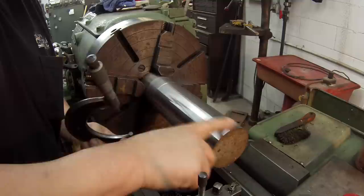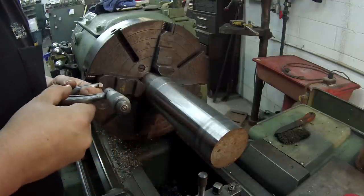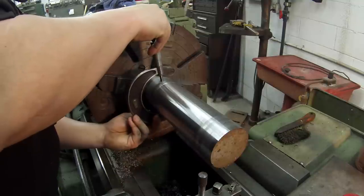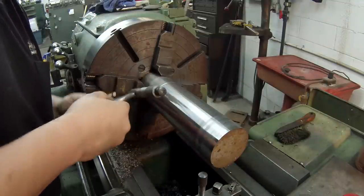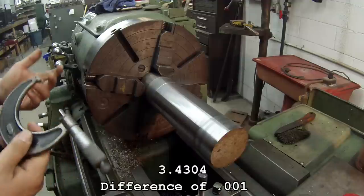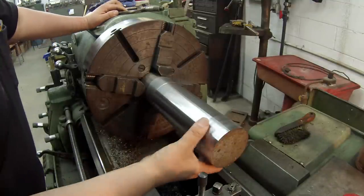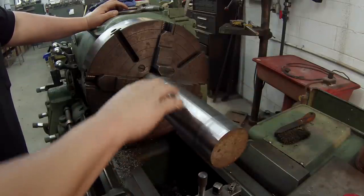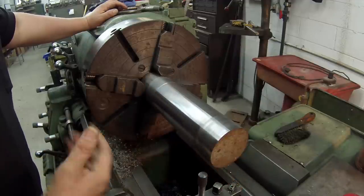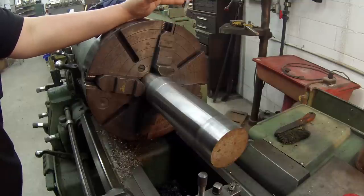Let's take a measurement. I'm reading 431 and 4 tenths on the near end, and 430 and 4 tenths on the outer end — so I'm getting 1 thousandths taper, a thousandths difference. Not too bad, but it is off. I would assume that's not push-off from the tool given it was only a 5 thousandths cut. That's why I went with a larger piece of stock — to maximize rigidity of the workpiece.